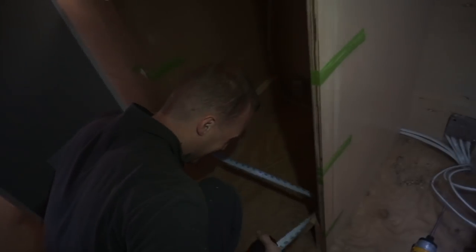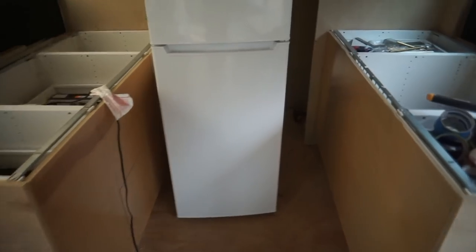These are the start of our platforms for the refrigerator box step-up thing. This should be twenty-three and a half — let's go cut a piece of wood twenty-three and a half by twenty-three. So I have elevated the refrigerator cabinet. I just have two pieces of three-quarter plywood here and here and this is resting on top of it. Eventually I'll have a drawer here. The back of the refrigerator needs space so it can breathe back there. My outlet's down there. I'm gonna put this in and then I'll show it to you.